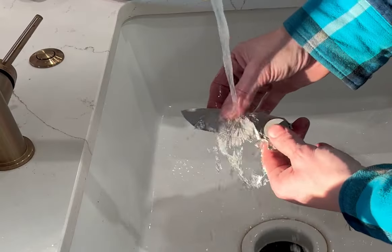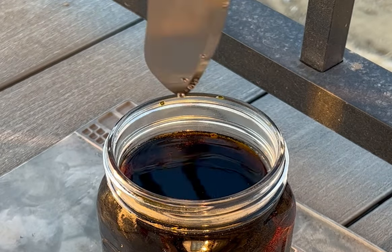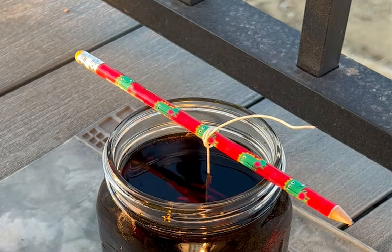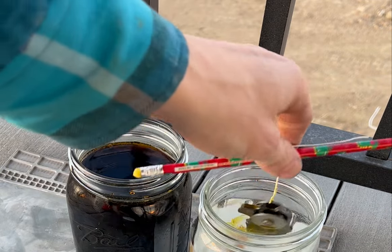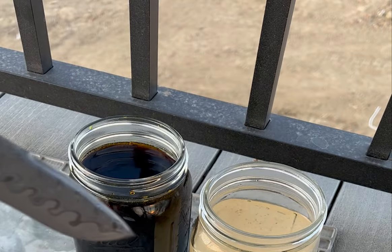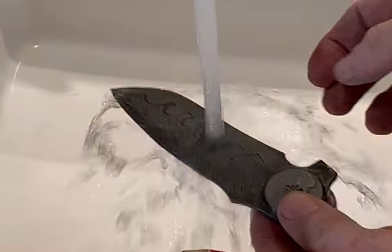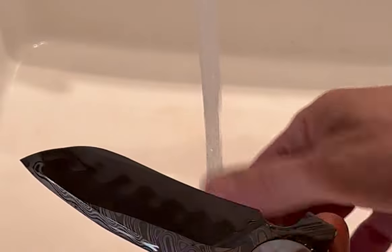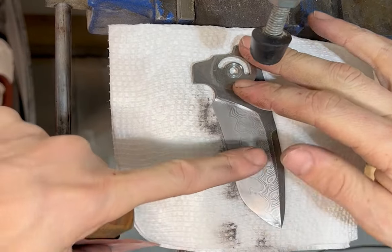This is one of my favorite new things I've been using on my knives. Next step is to clean it really well with plain sink water — just clean any WD-40 or residue off it. It's obviously okay to have a little water on it going into the acid. Leave it in for a minute and then start to see the pattern. Once you get it out of the acid, dip it into this baking soda and water solution, which will neutralize the acid and arrest the etch at that point. Also, you don't want to be dripping acid all over the place. You'll see here that when you etch it, it forms oxides, and if you rub the blade at this point you totally disrupt those oxides and make it look muddy. Don't be alarmed though — in this particular etch I'm using ferric chloride and we're going for depth for these first few cycles.